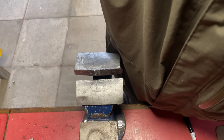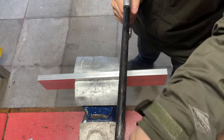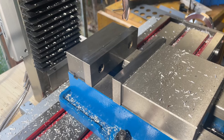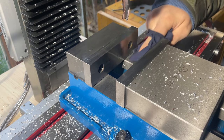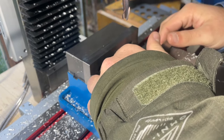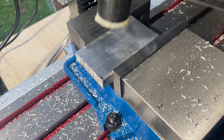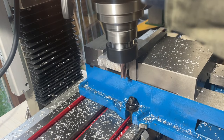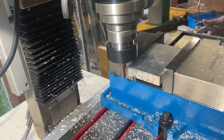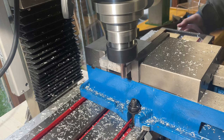To start with the first piece of this assembly I will be making the main body of this holder. For that I need to cut off a big piece of aluminum from stock, and because I'm not very gifted at using the hacksaw I will have to square it up in the mill. This also gives me the ability to then machine the part on the milling machine.